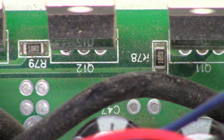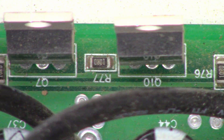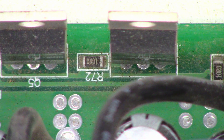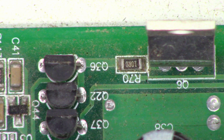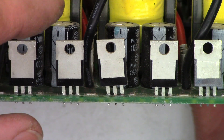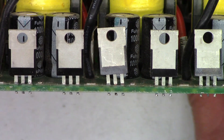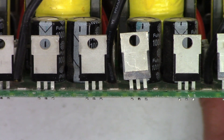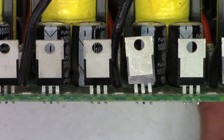Here is the other row of resistors — the 10 ohm resistors. They all look absolutely perfectly fine. I don't see any problems with those whatsoever, but I'll show you what I saw on the FETs. Somebody else has been into this thing multiple times, I'd say, because take a look at that one FET in the center. Only one lead is actually still connected on it. I think someone's had this apart multiple, multiple times. Let me show you why I think there is water damage on this unit.